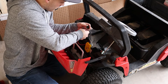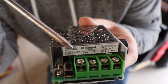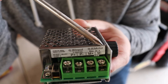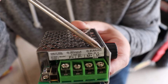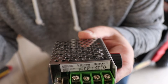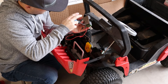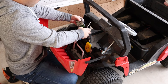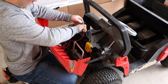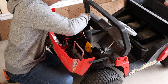To make this connection easy I'm going to use spade connectors to connect the wires to the switch terminals. Next is the motor controller. I'm going to connect the output from the switch to the positive power input terminal and the ground from the switch and battery to the negative power input terminal. I'll then connect the white and black wire from the car to the output motor terminals — the white wire going to the positive motor output terminal and the black wire going to the negative motor output terminal. Finish wiring this all up and it's good to go.